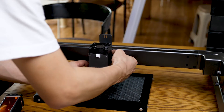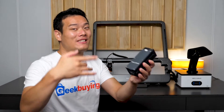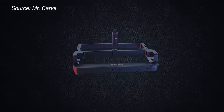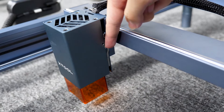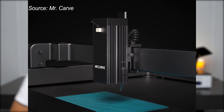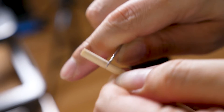As I mentioned before, one of the highlights of the M3 is its swappable laser head design — you can swap to the infrared pulse laser head as well. This one has exactly the same laser module from the first generation M1, powerful enough to deal with all kinds of metals. The focal distance for this laser head is 15.7mm. Since what I got is a prototype, it doesn't come with a range rod like on the X2 or D1, though Mr. Carve told me they will add that on the final version. I had to be creative and make a handmade range rod.